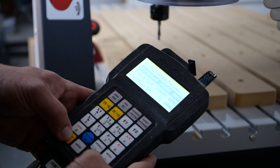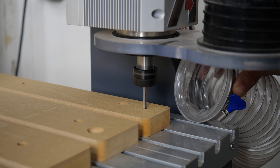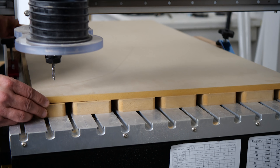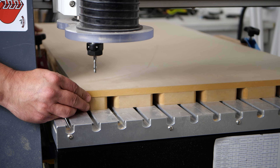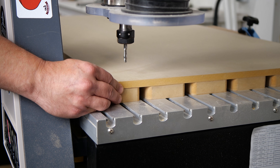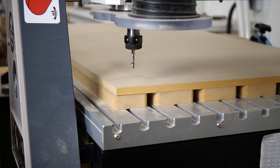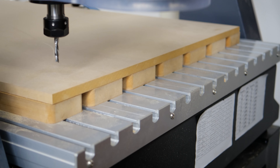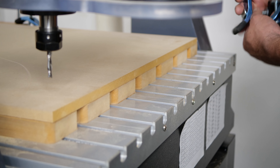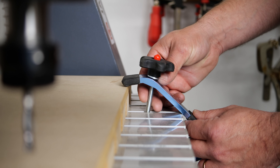Now this is the part where you move your board down to the second set of pinholes — move it down to the pins in the bottom of your spoilboard. We post-process those three toolpaths. I like to save them as Step 1, Step 2, Step 3, so when you're looking at your job sheet and take it over to the CNC, you can make sure you're doing things in the correct order.